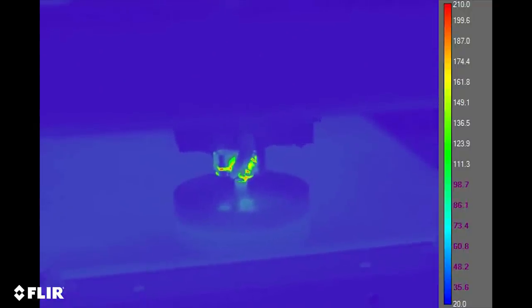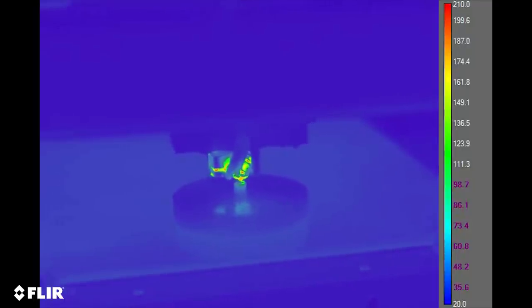And the reason that I wanted to print this spike thing here is the fact that really small and high parts are usually quite difficult to print, because the time that it takes to make one layer is really short, and the plastic doesn't have time to cool down. So sometimes things just get hotter and hotter when it's doing more and more layers really fast, and when that happens, then they don't get hard enough and they are melting or bending to shapes that you didn't want to make. But I think this software that I'm using tries to calculate that and avoid that by using slower speed.